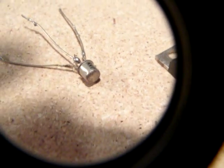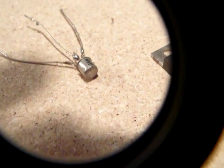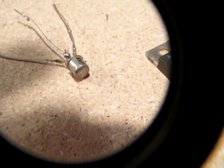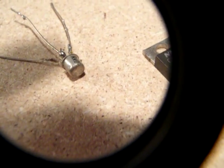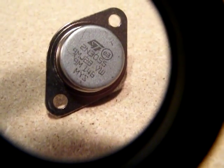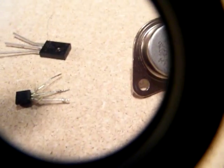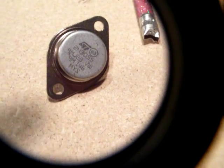This transistor, for instance, is a germanium switch transistor. It was used in an old computer board in the 60s. It's the ASZ21. I salvaged it from that board, I have many of them. A switch transistor also has to have good high frequency properties, especially when you want to make a circuit that switches at a high frequency rate. For switching at frequencies between, say, 10 Hz and 40 kHz or so, you can almost use every transistor. But when you want to switch at 10 MHz or 20 MHz, it's a good idea to use a transistor with a suitable frequency characteristic and good switch behavior.